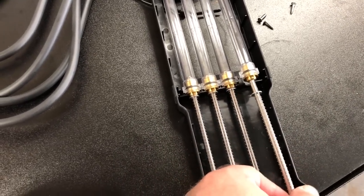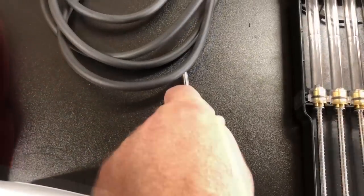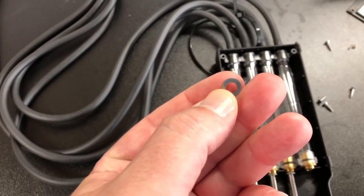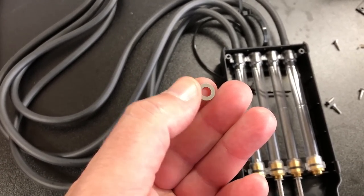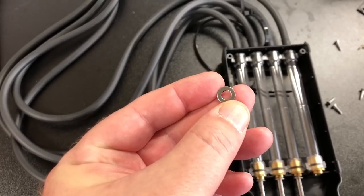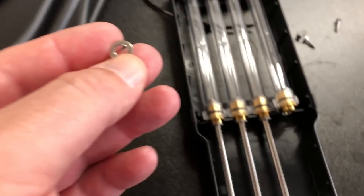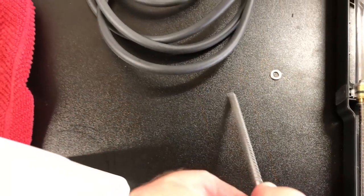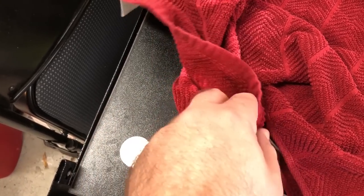Don't take that part off — just let it stay together — and then you can easily slide the rod right out. There's a washer and spring on here. The washer has a flat and a beveled side: the flat side goes down towards the spring. It's subtle, but that'll make sure you get the best seal up to the brass bits.